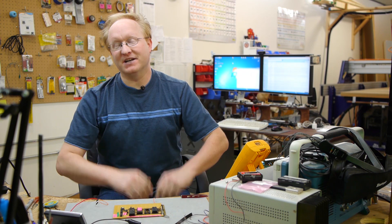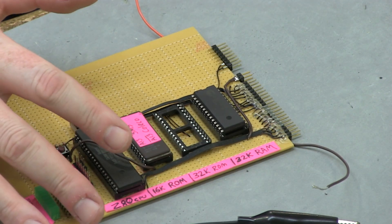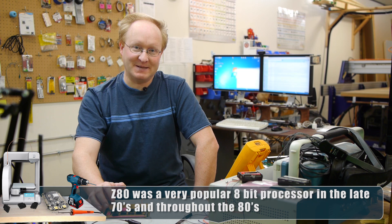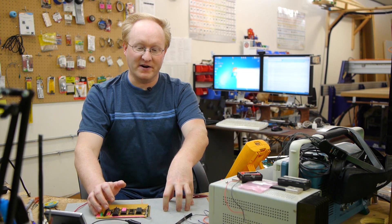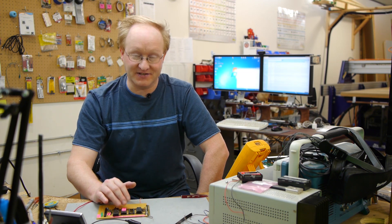Hello and welcome back to The Ben Heck Show. In today's episode, we're going to continue working on the Game Brains project, which is a project to combine several Z80-compatible systems together. In the previous episode, we created the Z80 core along with the ROM and RAM, and connected it to a Sega Master System motherboard through the expansion port. Today, we're going to remove the video processor from the Master System, put it on its own board, connect it to this, and see if it's backwards compatible with the ColecoVision. We'll also create a custom memory mapping solution so the system can automatically decide what system it's booting as.